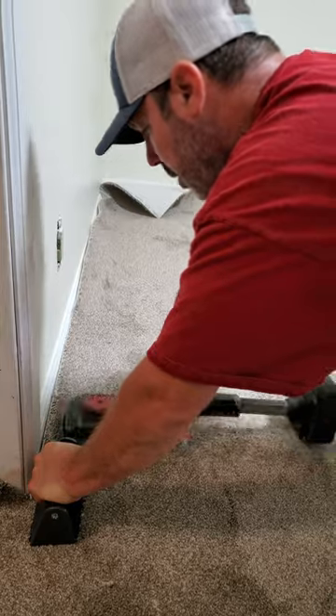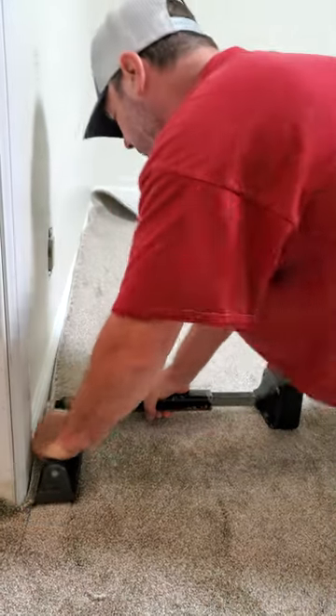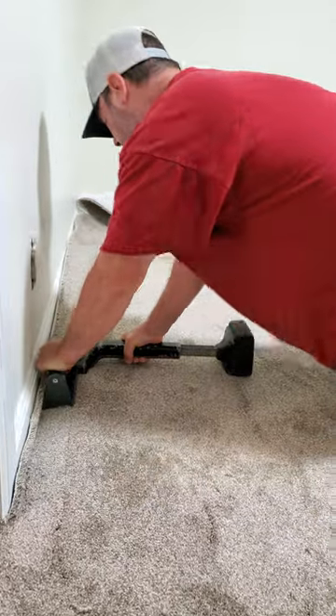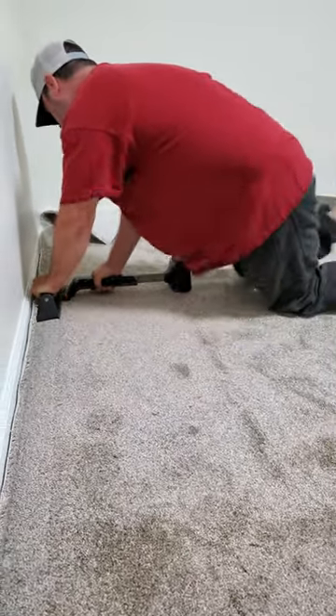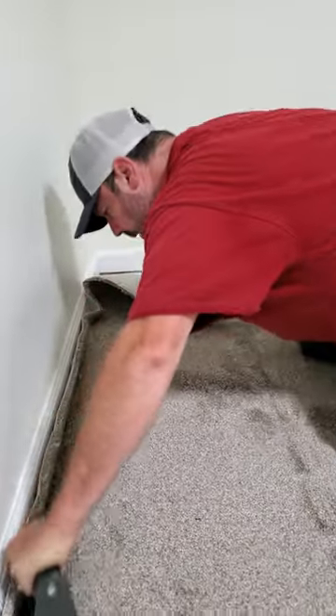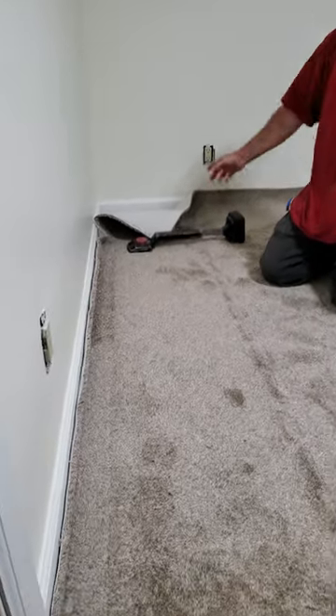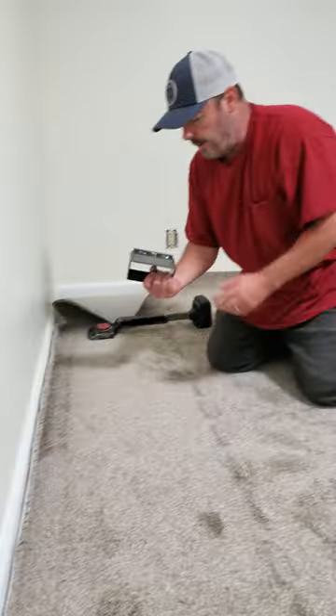Put it up there like so. Instead of using your fingers, put all your weight on it. You can rake it if you want — puts a nice perfect finish and you're ready. You're literally ready to trim that off. You don't have to go back with your stair tool. If you've got a thick carpet, you can go back with this and rake it real quick.